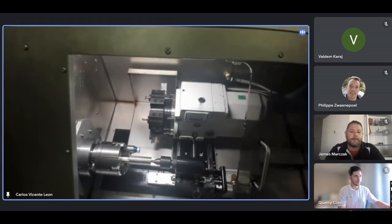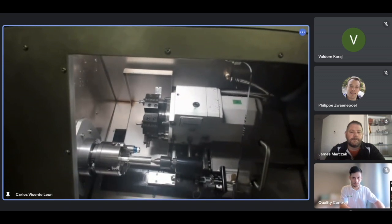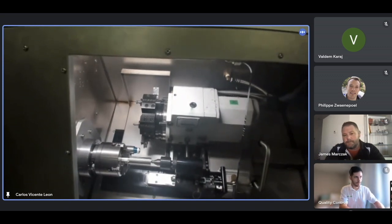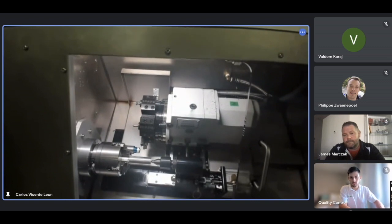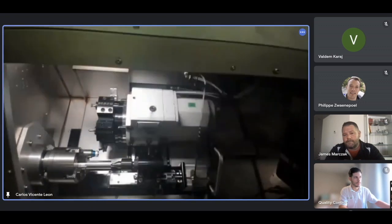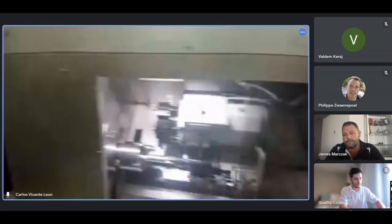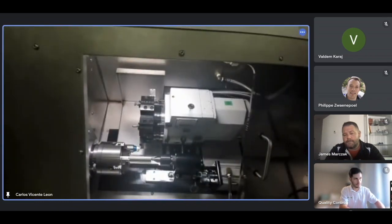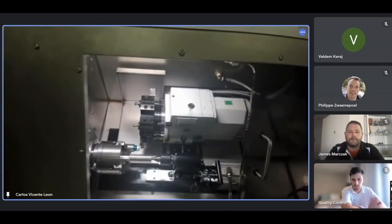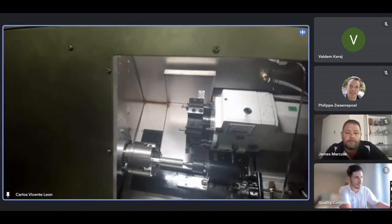The threading tool is a little bit more difficult. You just align it. Align the tip with whatever space that you have there. And then again, I do sensing. Okay. Now let's do X, diameter. Take this out, very important. Go to tool 1 again.